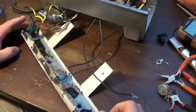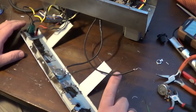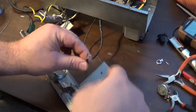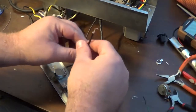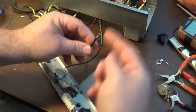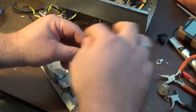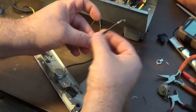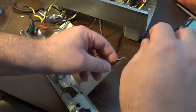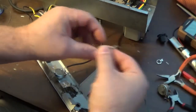First of all, the reason for this, from my understanding, is that whenever you have a shielded cable like this, the way these are made up is you've got however many leads you have inside. This one has 4 leads that are all insulated. And then you'll have one lead that's not insulated, and all that is surrounded by a conductive foil, and then you put the black insulator on the outside. And if you were to ground the lead that's not insulated, that will in turn ground the foil and basically shield all this cable.